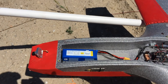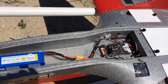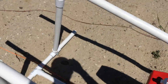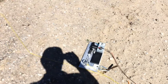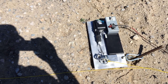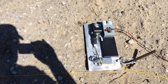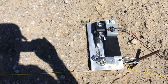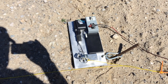I'm just using a smallish battery for the first flight to keep it light. That's a Pixhawk, not a Vector, and we've got a slick little electrical release because I didn't want to do a mechanical one. It's a sailing lanyard with a pole that's yanked on by a car door lock actuator, so we'll see how it works.